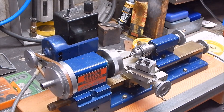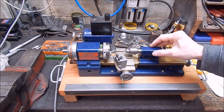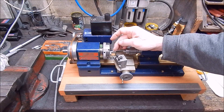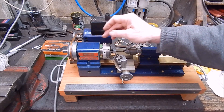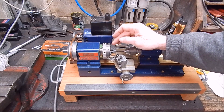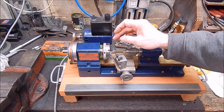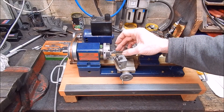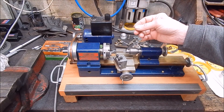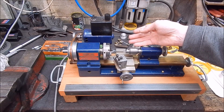There you go guys, job done. Next part will be to cut the steel rod to length, braze a nut on the end — the same as we did in the last video for the con rod journal — and then fit it to the flywheel. Put some Araldite down the hole we drilled and onto the power piston shaft, put the flywheel at top dead centre, set up the rod length, and let it dry overnight and harden. I'll just use two-pack, and tomorrow, if everything worked out — which it should — she could be good to go.